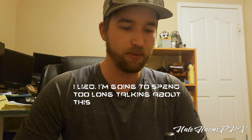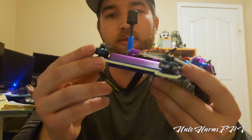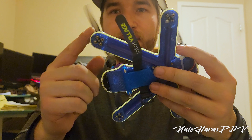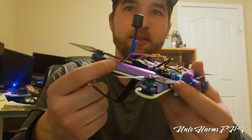If you're interested in trying one of these builds yourself, keep in mind it's not really better than a carbon fiber frame in any way. It looks cooler and it's free if you have a 3D printer — I can't think of too many other plus sides. It was a thought experiment, an engineering experiment. I'll put the files online. One thing to note: if you're using 1404 motors, the bottom mounts are actually too big — the holes I put in have a range of 10 to 15 millimeters, and these motors are about 9mm, so you'll have to dremel that out, which is really annoying.